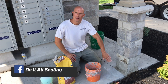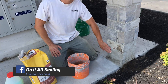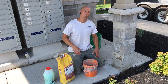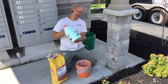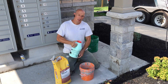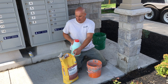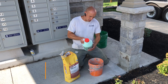We've allowed enough time for the VersaSpeed to dry — actually over an hour. We're ready to start applying the Sika123, so I'm going to go ahead and start mixing that. Before you mix it, you want to take the jug and give it a really good shake to make sure it's thoroughly mixed. Then you'll pour the quantity you need into a bucket and start putting the concrete mix in and mixing that thoroughly.